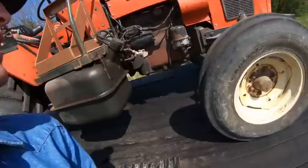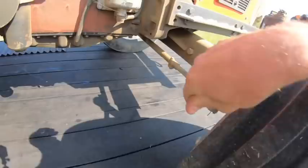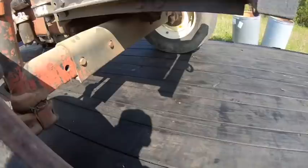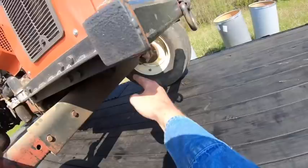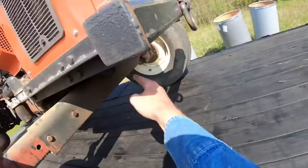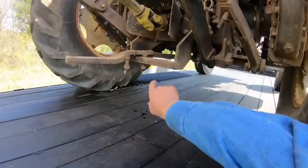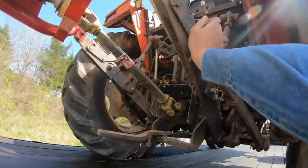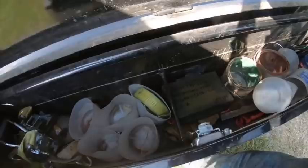A few disclaimers: make sure what you're tying stuff off to is sturdy. Don't be running chains through steering linkages. On this particular tractor, I put a frame on here with a D-ring on the front for pulling stuff, so I usually just run a chain down around here. Failing that, I'd probably go from the axle — it's going to push on that giant cast iron center block that'll take thousands of pounds of force. I go across here because tying it off where it hits the tire is something we also don't want. On the back of the tractor, I like to run across the draw bar. Do not tie off to anything that moves — so that would be the three-point hitch or the PTO shaft.